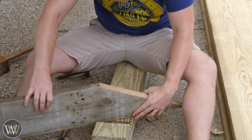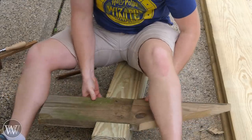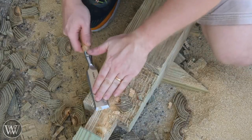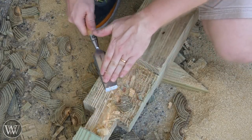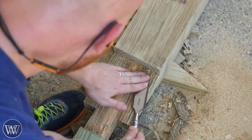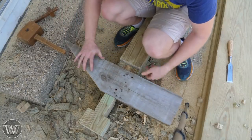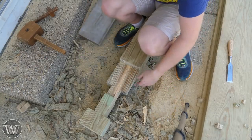We will be bolting them eventually, and then we'll house them down into the joint. You can see how it will fit down in there and then I can run screws into that. The 2x12s then go perpendicular to these across the other way. Here's one of the 2x12 slots, and you can see there's an overlap between the 2x10 and 2x12 — that's where the housing joints will connect together. We're having a little bit of fun cleaning these up really nicely.